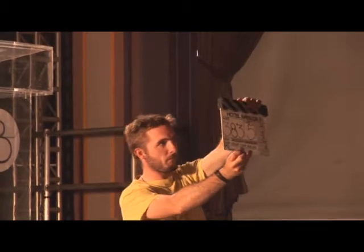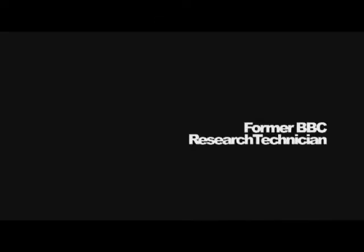An electronic camera set out of the box — even a top-end broadcast camera — will only do seven stops. That's all you can get out of it, or all you can get into it. If you let me loose on the controls on the top-end cameras, I can stretch that to 12 stops, because the cameras don't clip at peak white. There is more exposure available — they don't use the whole sensitivity range of the sensor.